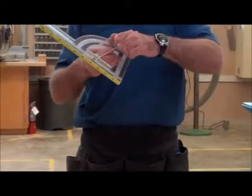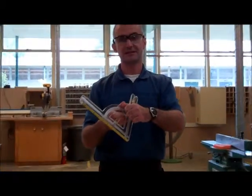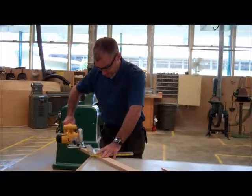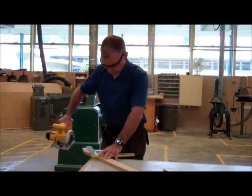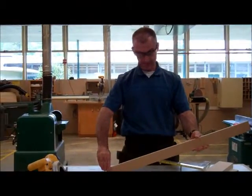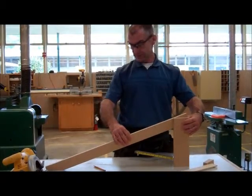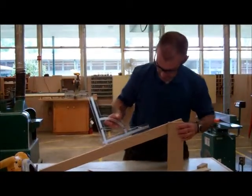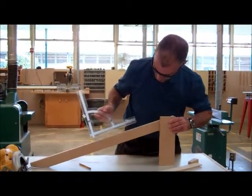My tool, both for that 15 degrees and its complement 75 degree cut, is all set as a layout tool. This is going to be a cut across the base — I can clamp it to get a little bit better. There's my first cut so my board sits flat on the ground. Then my next cut is going to be so this thing is cut at a 15 degree angle. Let me put this on there again and bring it exactly to 15. So there it is level. I mark it.